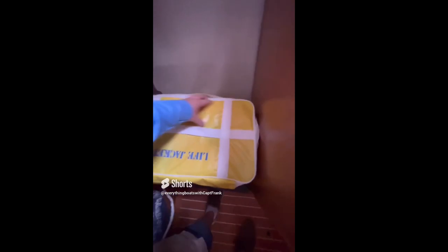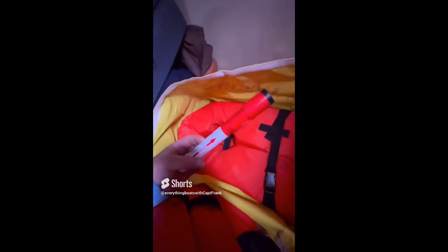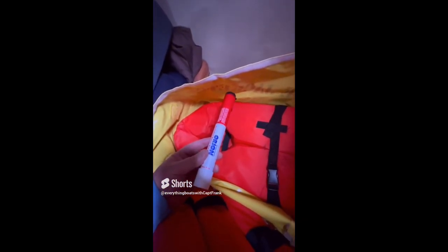For today's find, we're inspecting these life jackets. Open the compartment — and what have we got here? A propane canister. These should not be stored inside the boat; they should be stored outside so that if they leak, it would drain directly overboard. You can store them in a mesh bag on the rail or some other holder that drains overboard. But wait, it gets better — stored with the propane is, of course, a flare. Double trouble. The propane should not be stored in here, and the flare should definitely not be stored in here with it — even worse.